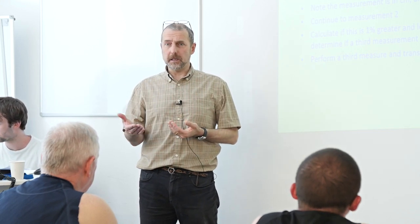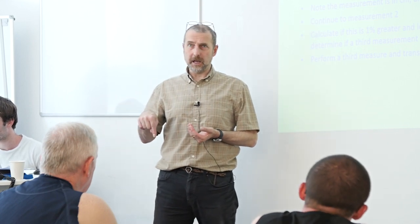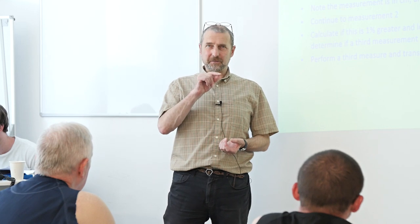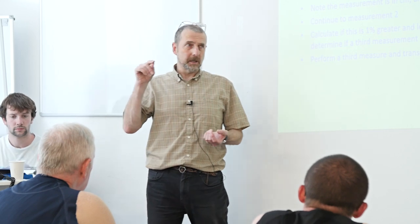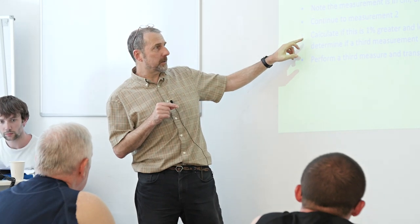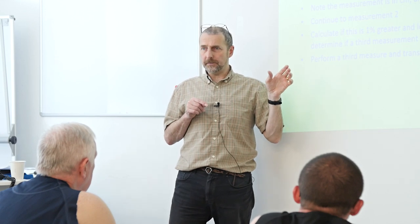I've run these exams a lot, so today's date will be the suffix for this particular measuring exam, which will have a record of your measuring in it. We see a lot of 47. We don't see 47.0 because I need to know that you have measured to 0.1. So even if it is exactly 47 centimeters, it goes in as 47.0. The spreadsheet, as I've said, will calculate if they're more than 1% different. And I'll show you that on the spreadsheet themselves.